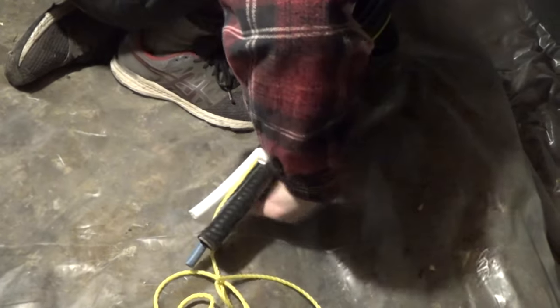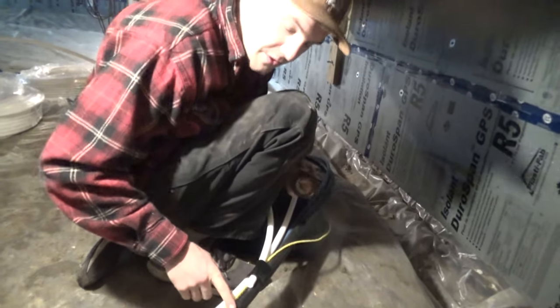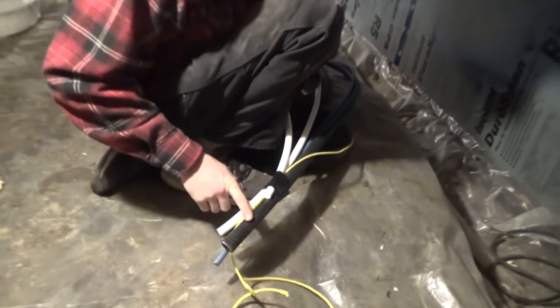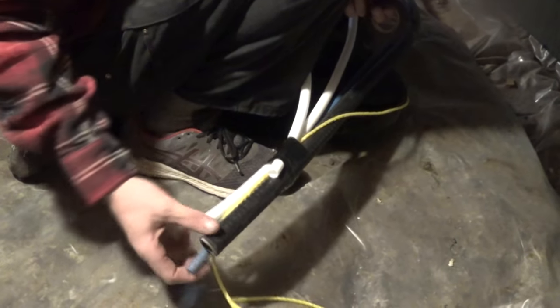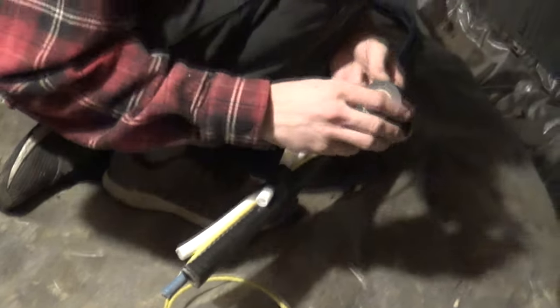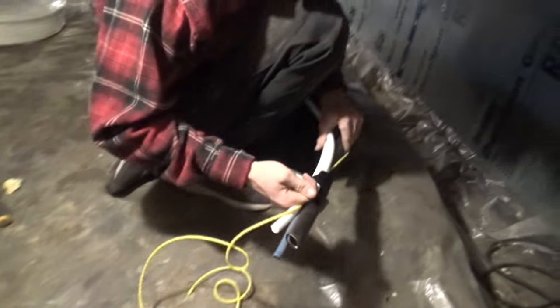All right, so here we are. We're setting up our pull from the crawl space under my house. We have number two ACWU for power. It could be on a 60 amp, but you could go up to 80 or 90, I believe, in the code we're currently on. Armored Cat 6 for data. Two pieces of PEX, one for air, one for water for future use. A one pull rope for future use.